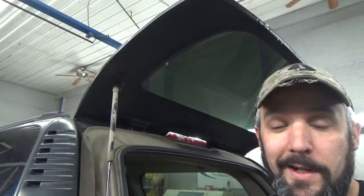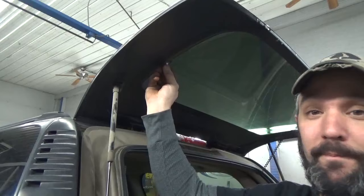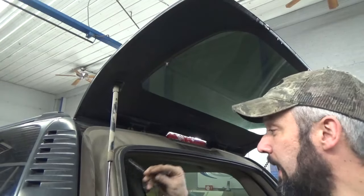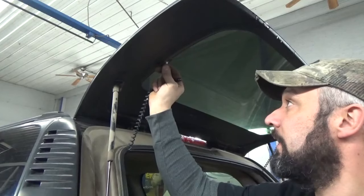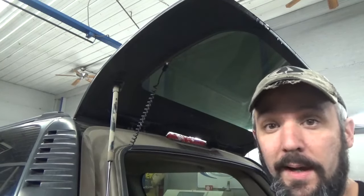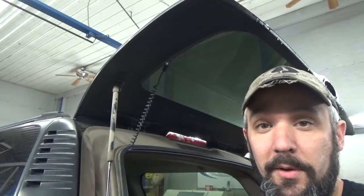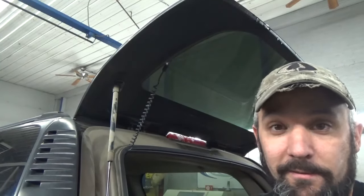I think there's really hardly any cost to this whatsoever — just a little tiny piece of solder. When you get all done, I think it's locked on there real good. You don't have to worry about that. This tab here is actually bent out a little, so I'll just take and bend that back in. Take our wires, clip it back on. A real simple fix — just something you can do when the customer waits, and you don't have to worry about dozens of these things.